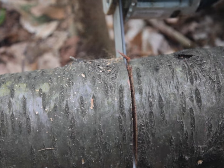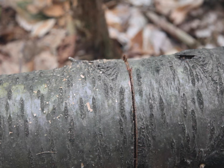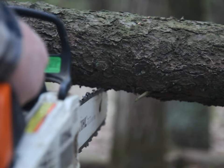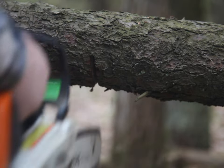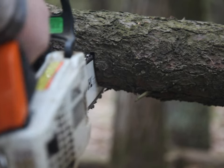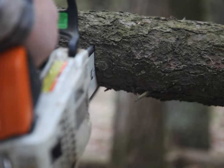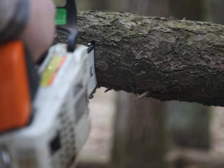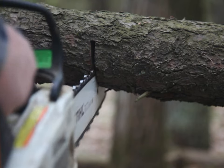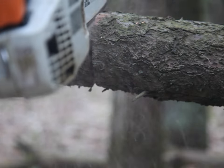With many cuts into logs on the ground, you can watch a cut carefully to see if it begins to close while you are cutting. If it begins to close, you should stop that cut immediately. Working from a ladder, you will only be able to see the near side of the cut. One way to judge the closing is to proceed very slowly and try to periodically wiggle the bar from side to side. If you get to where the blade can wiggle very little, it's time to stop progressing cut two and move to cut three. Cut three is easy to make, but its completion triggers the most dangerous few moments of the entire operation. We will get into that in the section on perch maintenance.